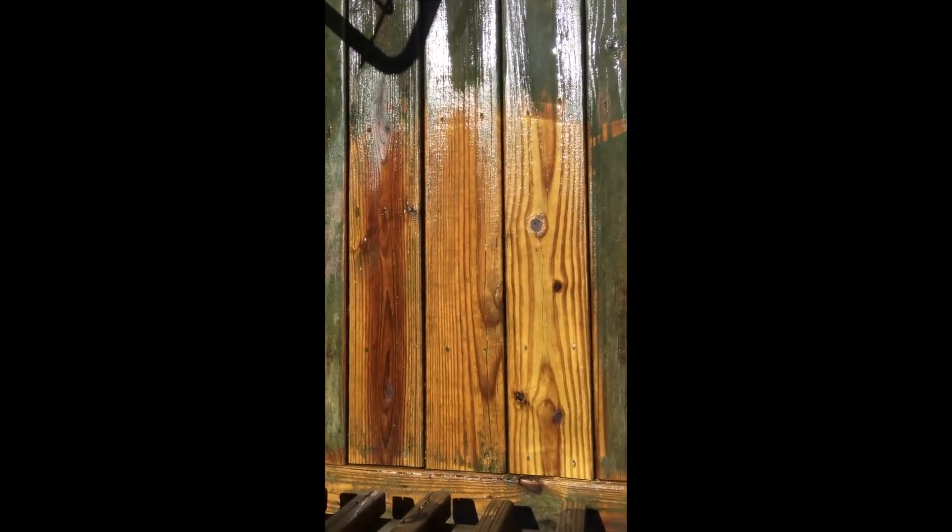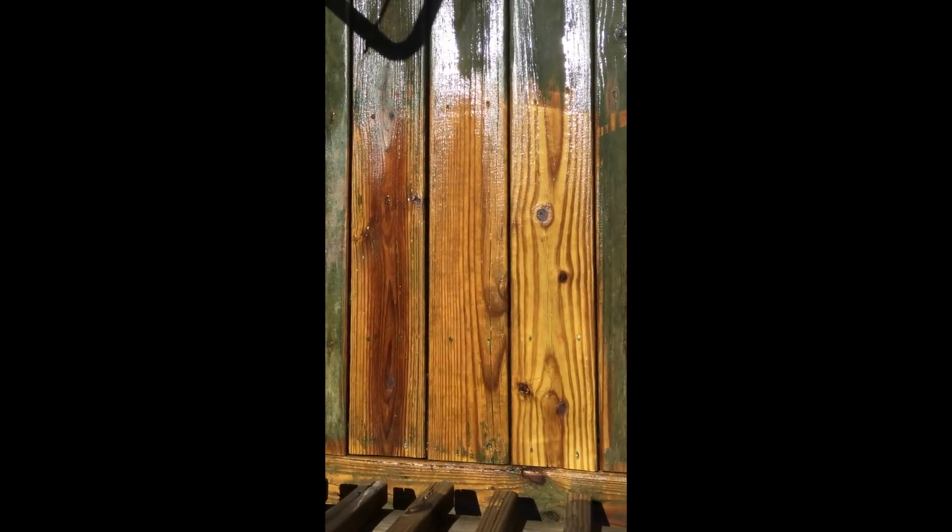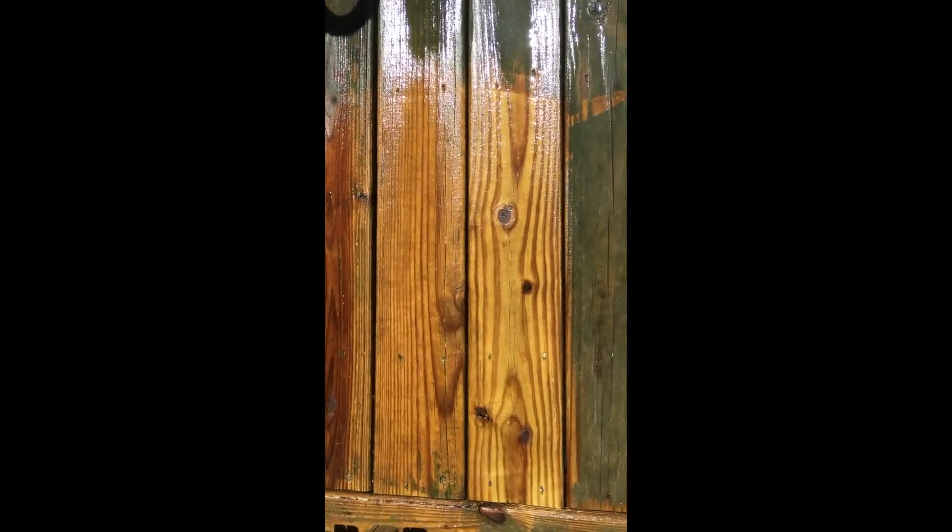I let the Restore-a-Deck cleaner sit for about 15 minutes. I took my scrub brush and did 20 passes back and forth on each board. The lowest board was the one that was pressure washed close to the wood. The middle board had one pass with a pressure washer, and the third board had no passes with the pressure washer. The heavily pressure-washed board is almost perfectly clean but you run the risk of damaging your wood. The lightly washed board still has a little bit in the grooves, and the unwashed board has a little more stuck to it. I'm confident that with two passes of the Restore-a-Deck cleaner all these boards would be as clean as the first one. I'll test that once I start cleaning the whole deck and I'll let you guys know.